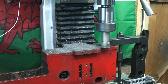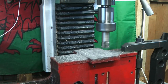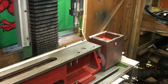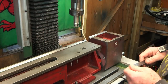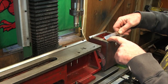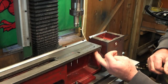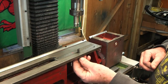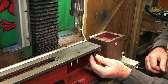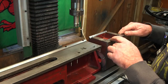Going back to the headstock we've been working on - I do want to drill that fourth hole to hold the headstock down. There are only three bolts as we saw when I stripped it, and I'd like there to be four. The standard centers of the holes are 85mm, which I can get away with in the head without breaking through the wall, but if I try 85mm here, to keep the pattern square, my bolt - a cap-headed allen bolt coming in from underneath - is going to be fouling on the rib on the underside. So I'm going to have to drop it back - the minimum I can go is about 83mm.